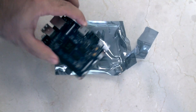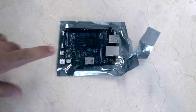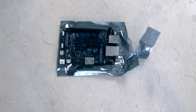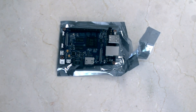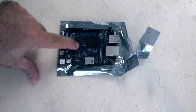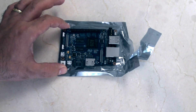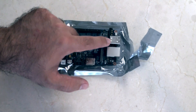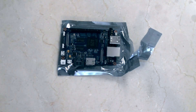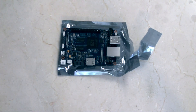I like that, but you can see that it's meant to be orientated that way, with the B-Pi written there on it. This has the AllWinner A20 processor, which is an ARM Cortex-A7 processor. This is the dual-core version, the A20, running at 1 gigahertz. This has 1 gig of RAM, you can see it there. The form factor is a lot like the Raspberry Pi, not much different. There's only two USBs as opposed to the four on the new B-Plus models. It's got quite a number of pins here — that looks to be about 40 pins.